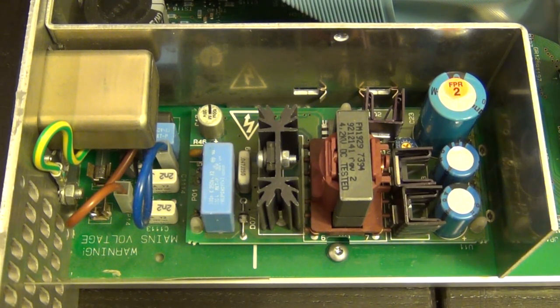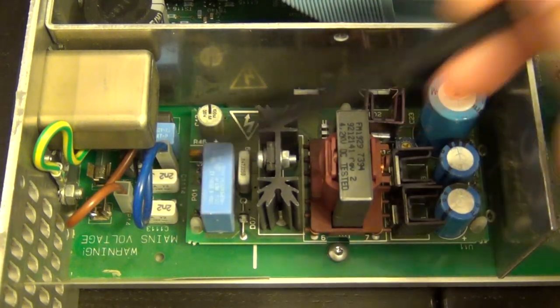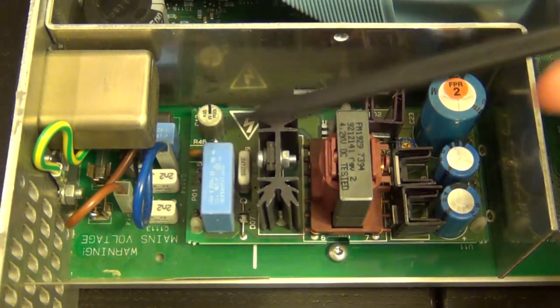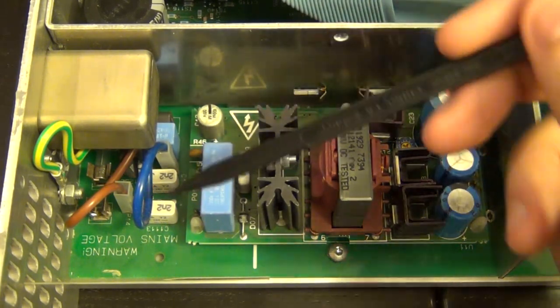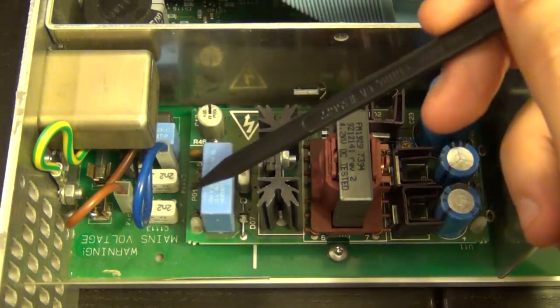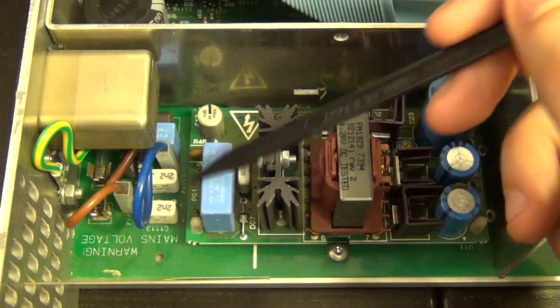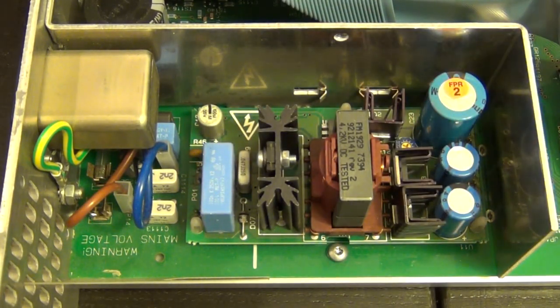And yeah, let's go ahead and plug it once again in, and we can measure one step at a time. I'm interested to see if the rectified voltage is okay there, and that would be a good start. If that is what it should be, roughly square root 2 times the AC voltage that I have, then I'll be happy with that. And then we can go from that and keep doing measurements.